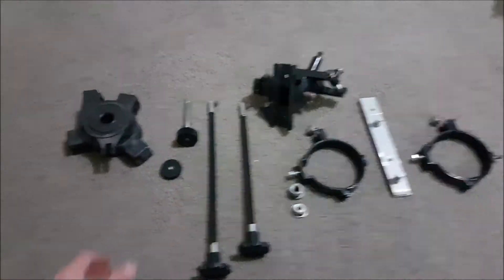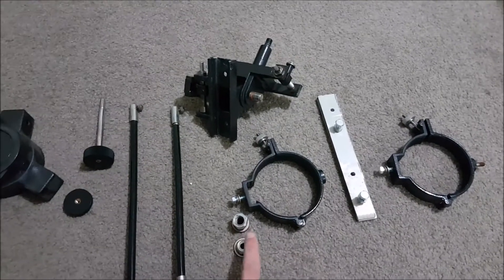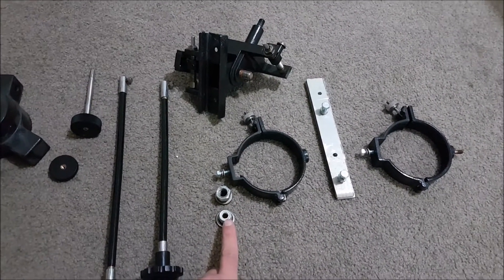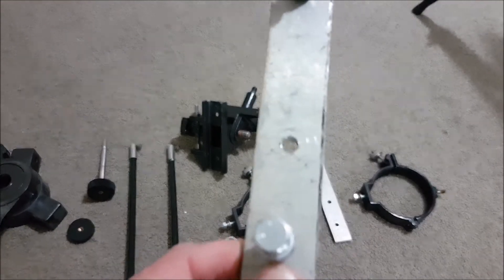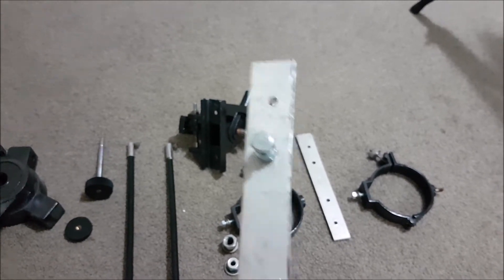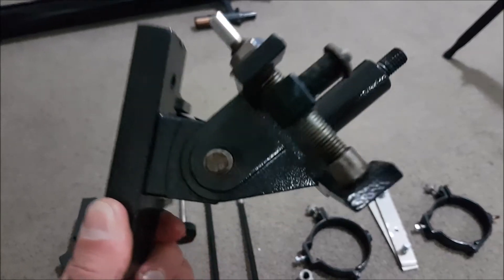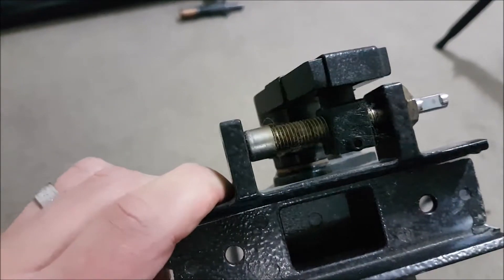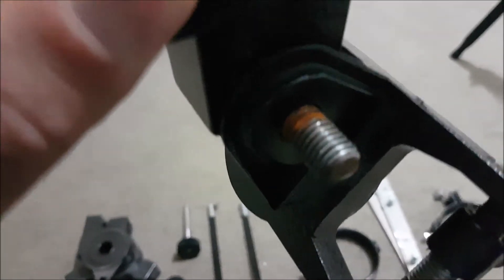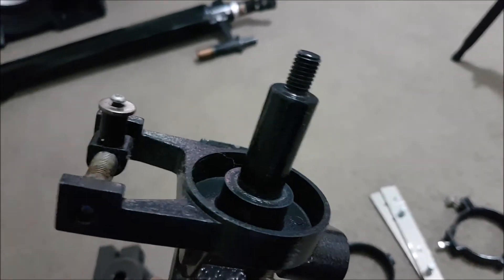I've finished taking apart as much as possible of the mount. I managed to free up the azimuth range. Control cables are all fine. These are the bolts for the azimuth axle; that's the bolt for the altitude axle — I'm going to be cleaning those up. Just have a look at this mounting plate — seems like it was an aftermarket or after-purchase job, looks like it's been drawn and cut probably by hand. Maybe the mount wasn't working at the time they purchased it. These are the attachments for the smooth control. The screws themselves have just got a lot of dirt, so I'm not going to take them out — I'm just going to give them a really good clean. There's the altitude axis with a little bit of rust on two of the threads, so I'll give it a quick clean. The azimuth axis has no rust — just a bit of grease — so we'll keep that on and reuse it.